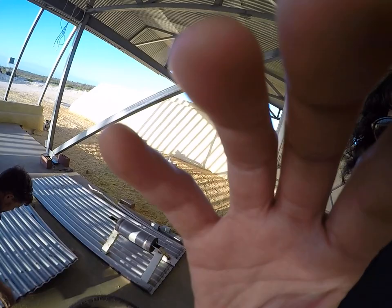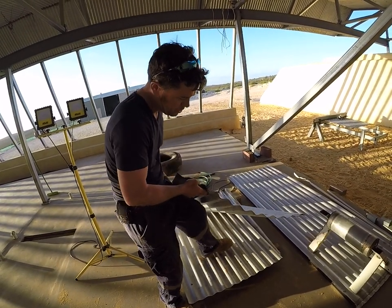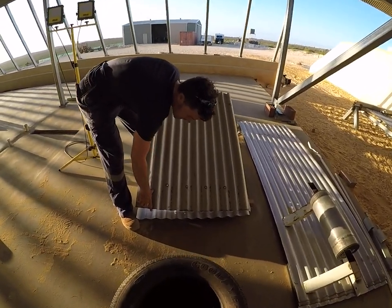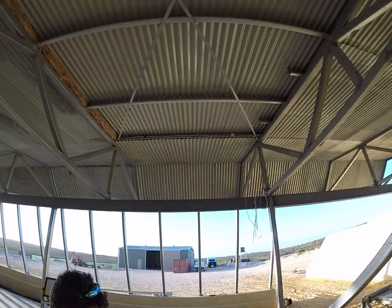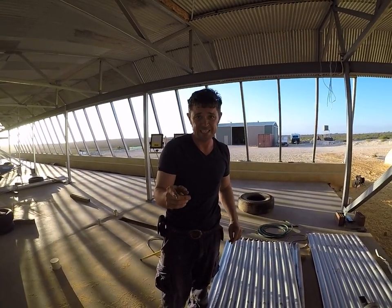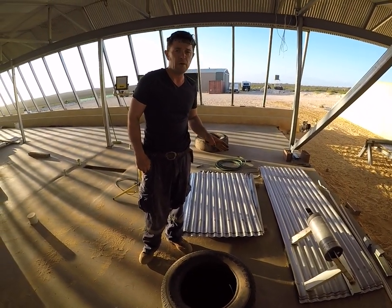Putting this tin up — we're using recycled corrugated iron. There are a few pros and cons. Pros: it looks awesome once it's up. Cons: we found four different profiles. When I say profiles, I'm talking about the corrugation shape — there seem to be a lot of different manufacturers with slightly different profiles, and when it comes to joining them up you can get gaps and have to work hard with the screws to pull the tin together. The other downside was collecting it — everybody seems to want the stuff so it's actually worth money, so we did have to pay for a lot of it from salvage yards.